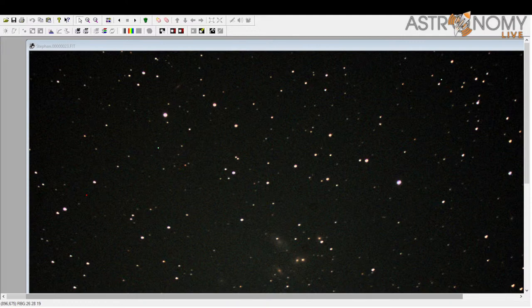Oh, I know what it is. Ah, yes. Oh dear, okay. I didn't foresee this scenario, is the issue. The telescope is polar aligned. That's the issue. See, I thought I was all clever, modifying it so it would send out commands to get around the LX200 Classic's rather restrictive accuracy when sending right ascension and declination. It's a long story, but my fix only works when the telescope is Alt-Az aligned, and when it's not Alt-Az aligned, it doesn't do anything.